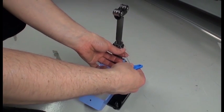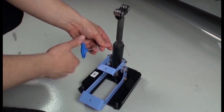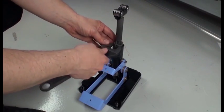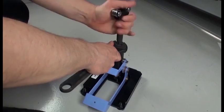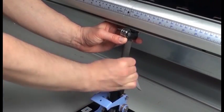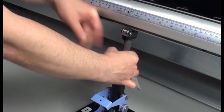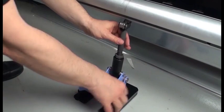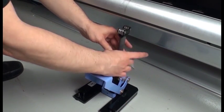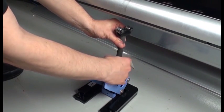Unlock the center support rod of the input spindle support. Adjust the center support under the center mark of the single input spindle. Once adjusted, release the support rod and lift the rod one additional turn. Then hand tighten the lock nut.